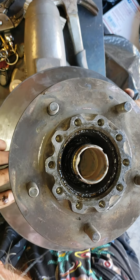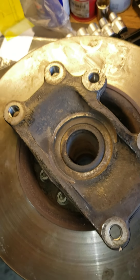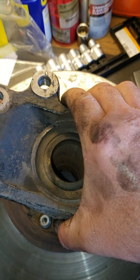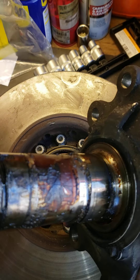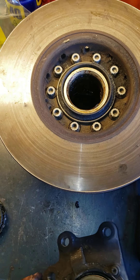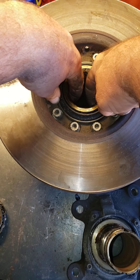We can just go ahead and lift the hub off as such. We gotta lift this up, turn it around. This is gonna pull right out of here just like that — look at that. And there we go: we have our screws here, we have our shaft here that's screwed onto there with those allen wrench screws. So we can set this aside, and then we have our bearing right here.